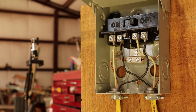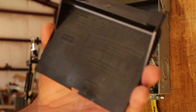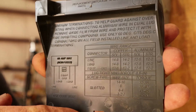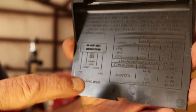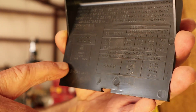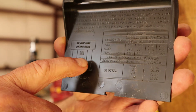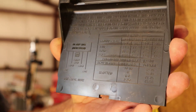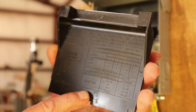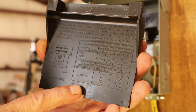I made a little addition to the video. If you look inside this specific switch, you'll see it's telling you the directions right there — line, line, load, load, with ground in the middle. It's pretty self-explanatory, but I know the video helps a lot of people, and I'm hoping this video shares information that will be helpful to you as well.